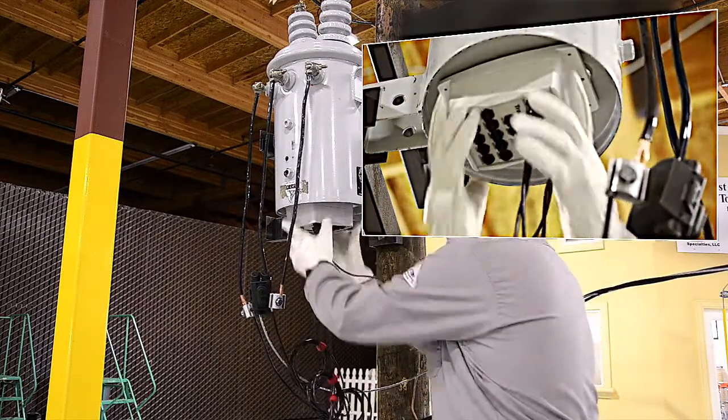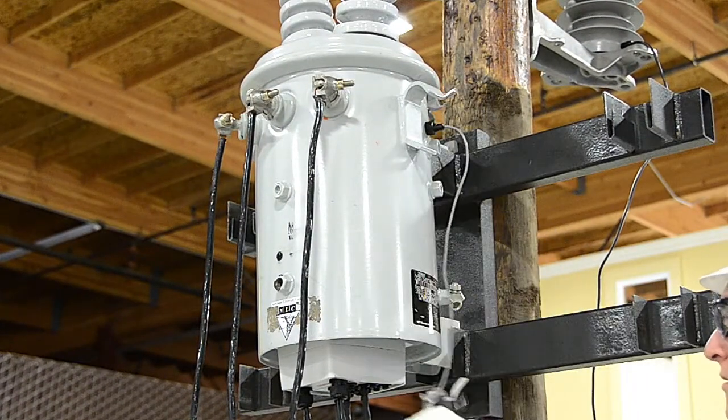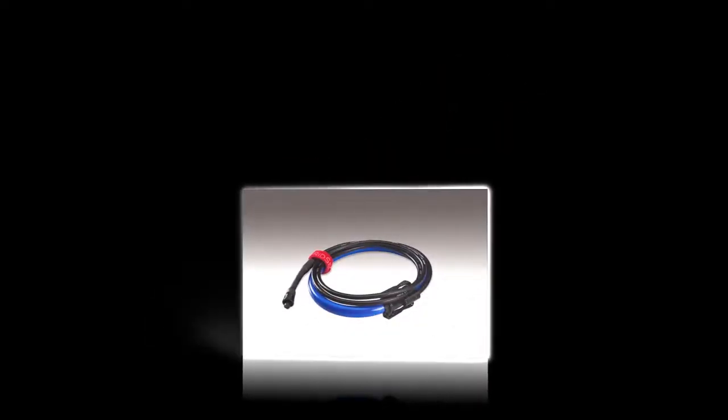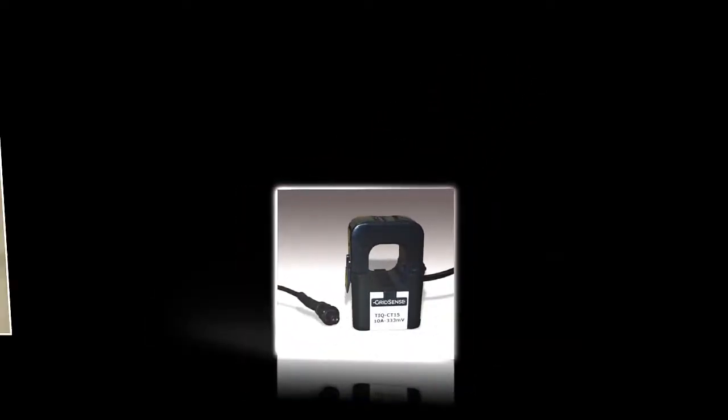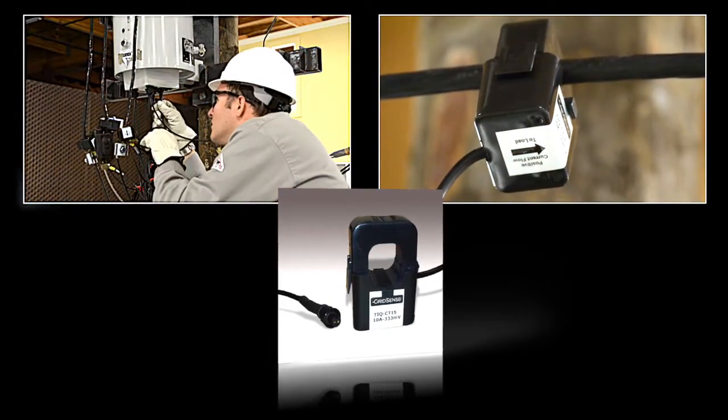You can hear the force with which the unit adheres to the metal. RTDs also attach magnetically for measuring oil temperature. Rogowski coils, or clip-on CTs, measure current flow from the transformer — one for each phase and the neutral.